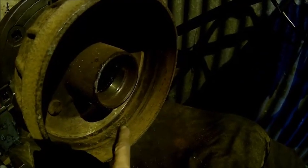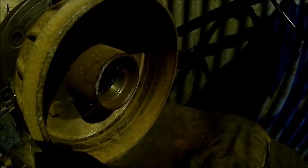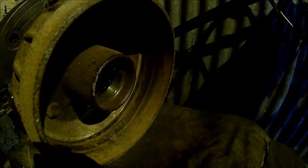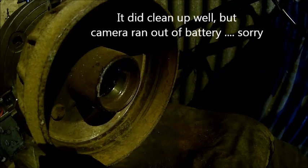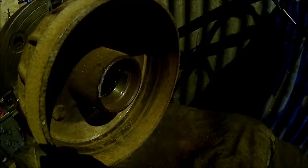It's not too bad. We got a typical wear pattern — on these drums the outer side is always a bit more worn than the inner one; that's just how the brake is designed. We have a bit more at the bottom where the scoring was, but it cleans up quite well. I've got plenty of material to go compared to the other ones. I didn't change anything on the setting, so I know roughly where I am — probably about 0.1 to 0.2 millimeters to go until I reach the average of the others. I'm quite confident this cleans up well.